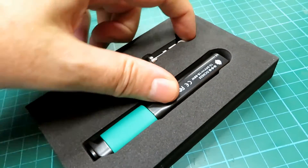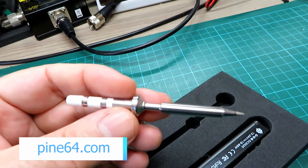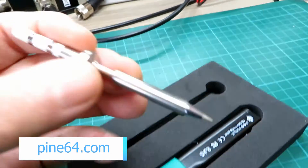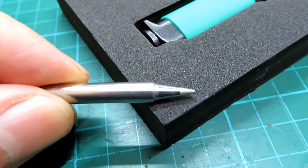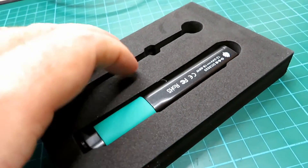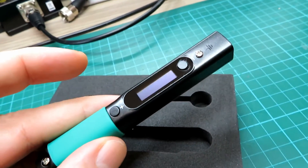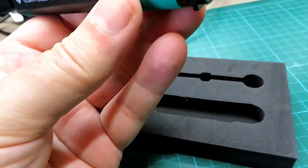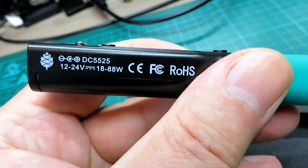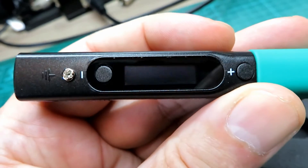It's drop shipped — the company appears to be in Canada but this was actually drop shipped from China. I'll put a link in the description to the website where you can get these and they're really nicely made. It just comes with a standard conical tip, which is about the perfect size for the stuff that I do. A lot of technicians actually use this type of pencil for their day-to-day soldering work. It has a foam grip at the top to stop it getting too hot, and it can run off an external supply of 12 to 24 volts at 18 to 88 watts, and it has a little on-screen menu.